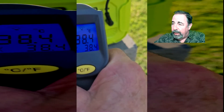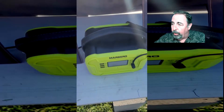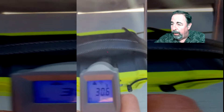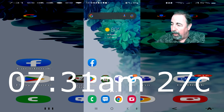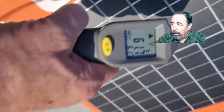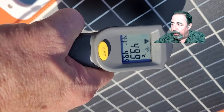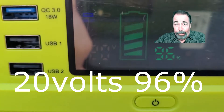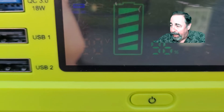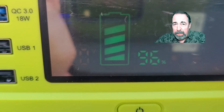Checking the temperature of the battery because you can see it's getting some sunlight. It's starting to creep up, so I'm going to move it behind the solar panel so it has some shade. Yeah, that cooled it off a little bit. 7:31 a.m., temperature's up a lot — 27 Celsius. Almost to 60 Celsius on the solar panels. I don't know why this side registers cooler. We're getting 20 volts off of that Flashfish folding solar panel and we're up to 96% — this after basically an hour.